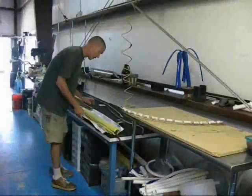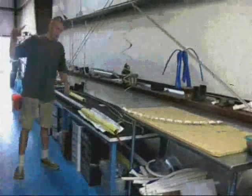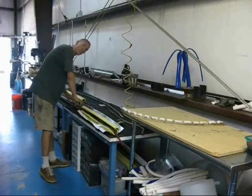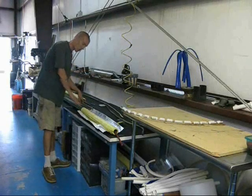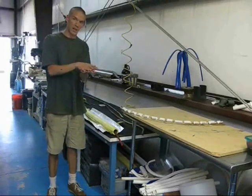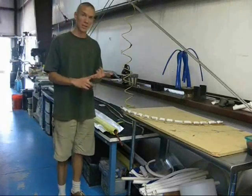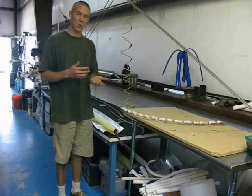Close the bend station. From time to time you're going to want to check the pipe and make sure you turn it so that the bender stays on the bottom and transfers evenly. It will always heat the part that's closest to it the most, so the place with positive contact is definitely going to cook more. If you want to avoid grill lines on the inside and uneven heat, you need to just keep rotating that pipe.